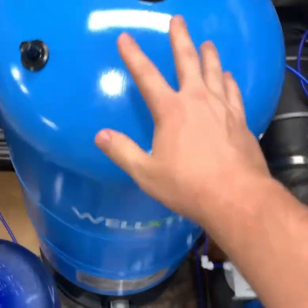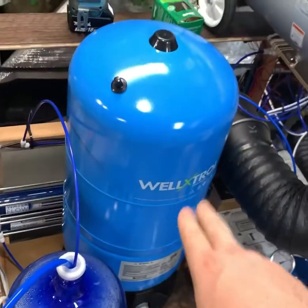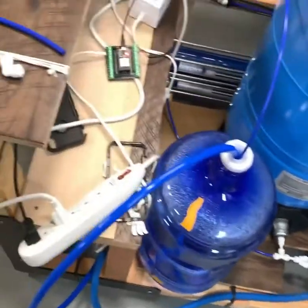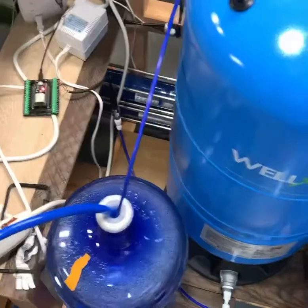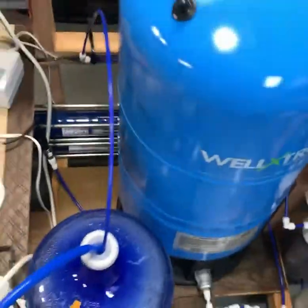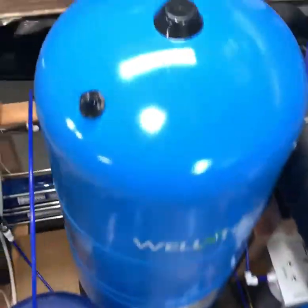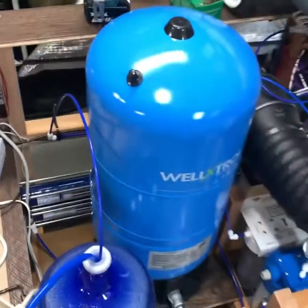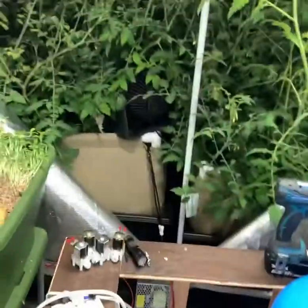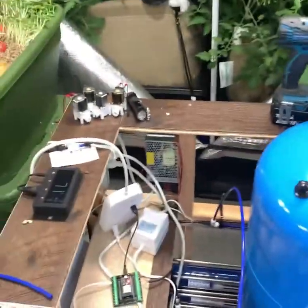Because this is an analog pressure sensor I haven't been able to automate the filling of the pressure tank. Every time I've wanted to fill the tank I have to come down here, push a couple buttons, and then it filters through the water and fills the tank. This means I haven't been consistent with my watering because the tank hasn't been consistently pressurized — it often drops to zero psi and I'll have rounds where I don't water the plants.